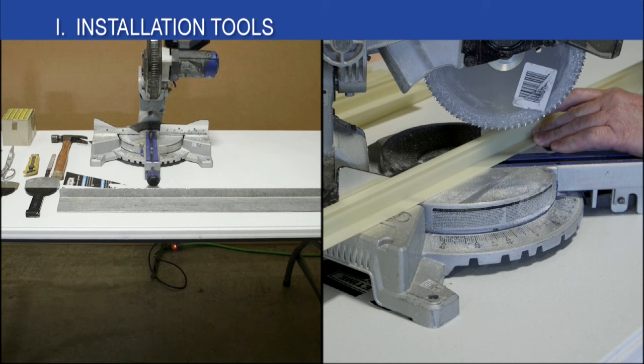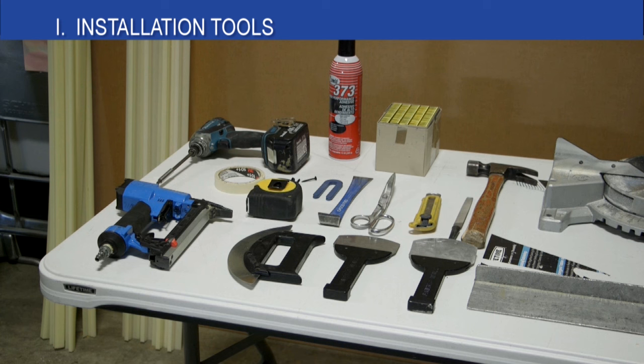To cut the track, you will need an 8 or 10 inch miter saw. The blade should be ultra thin for cutting plastic with 200 teeth per blade. We recommend the Magna 10 inch with a plywood blade, not a carbide tip blade. The stapler shown on the left hand side of the table is used to install the track for drywall installations. We recommend using a 3/8 inch crown stapler such as a Senco SLS25XD, which uses 3/8 inch wide, 1 inch long, 18 gauge staples such as the Senco M13BRB.